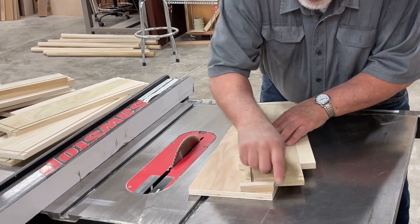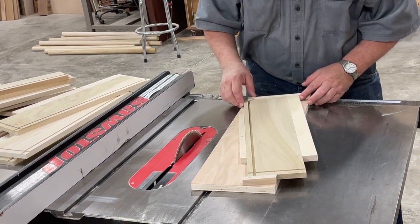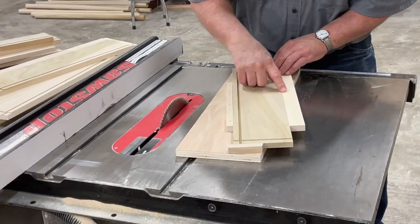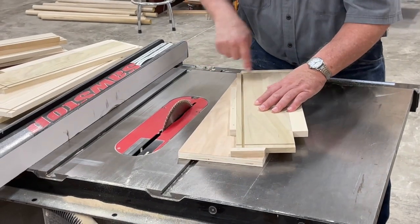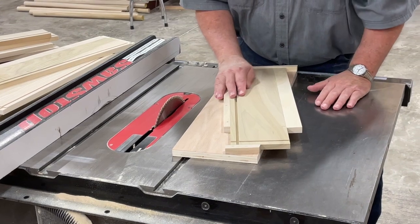And so we set our side on this piece of wood. We marked it 2 5/8, and we lined our 2 5/8 up with the back, and then we set our back here so that it doesn't go all the way back. And then we nailed on some pieces to hold it in place. And I want you to watch me put this through the saw.